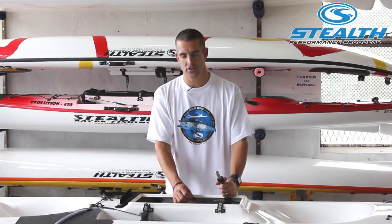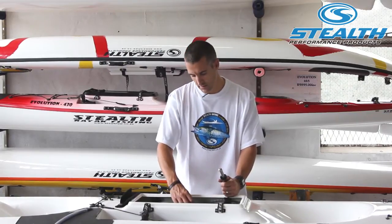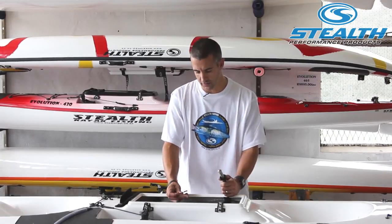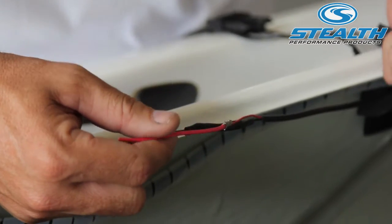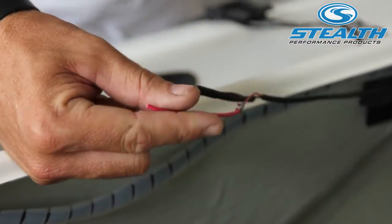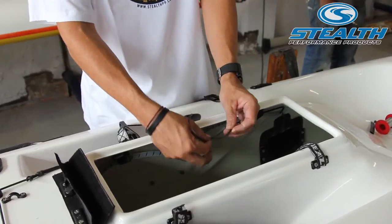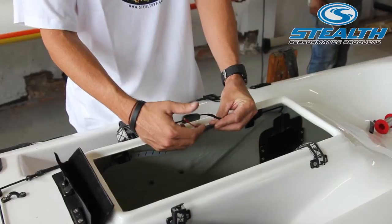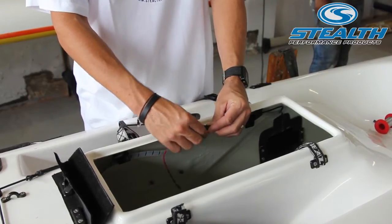One of the things we've learned when fitting a fish finder onto a kayak is that all your power cables on a fish finder are generally very thin wiring. With the nature of a fishing kayak and the amount of water, splash, and moisture, these little cables often suffer from what you call the black death — corrosion where the wiring actually goes black and stops your fish finder from working. So what we have done here is joined a thicker cable onto the thinner cable using solder so that you won't get the black death or corrosion. After that we put a little bit of heat shrink over the join and heat it to shrink it around the join, keeping moisture off and stopping it from corroding. Then we use a bigger piece of heat shrink over both cables together to seal them completely from water.